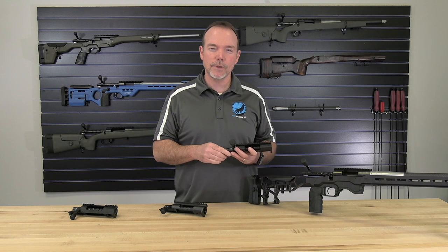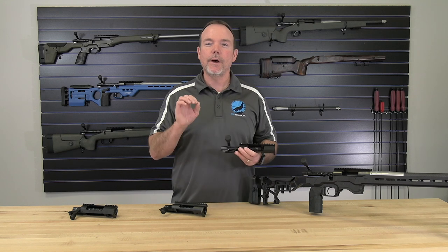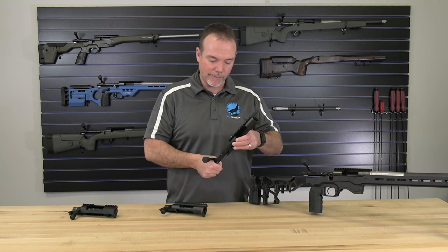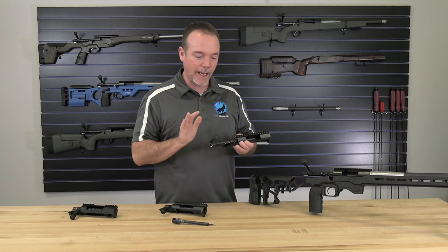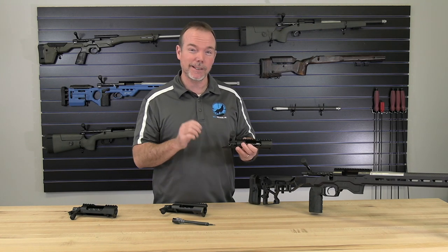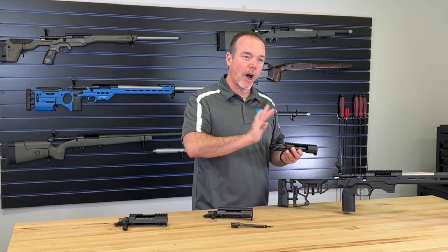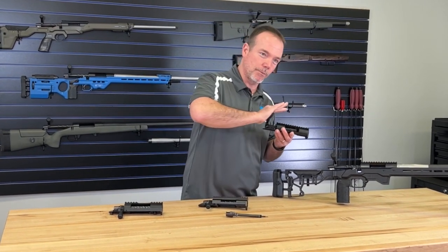The reason they don't bind and the reason they run so fast and smooth is because the bolt can't shift or kick sideways as you're opening and closing it through the receiver. If I take the firing pin out and just run it back and forth, it doesn't bind simply because it can't kick sideways. The mistake many other action makers make is leaving seven to ten thousandths clearance total — three and a half to five thousandths per side. As they push the bolt forward they're kicking the bolt body off to the side, binding it by moving it sideways and then forcing it through, causing the bolt to bind, stick, and catch.